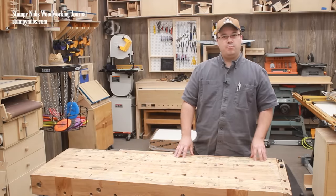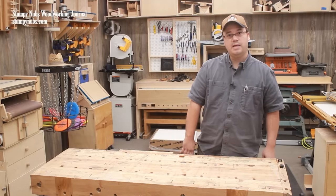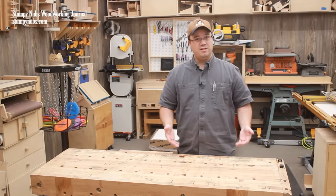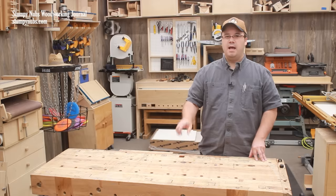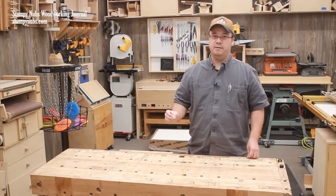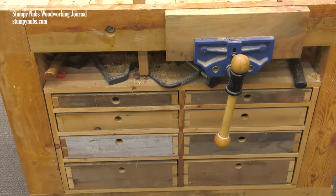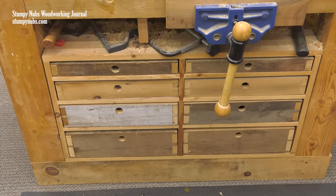The height of the bench has served me well too. I tend to prefer somewhere around wrist height. Others like the center knuckle when they have their arm down at their side — it really depends on what you use your bench for. If you do a lot of hand planing, knuckle height will be comfortable. If you work mostly with power tools, wrist height or even a little higher will bring your work up closer so you find yourself bending over less. We have a video all about choosing bench height — I'll link to that below. The yellow pine in this bench had tight growth rings so it was very heavy, and the tool cabinet really added some heft so that it just does not move around the floor when you use it. If you didn't want to build a tool cabinet, especially if you're using Douglas fir or lighter pine, I would consider adding a platform to the base with some cement blocks or sandbags to give it a little more weight.